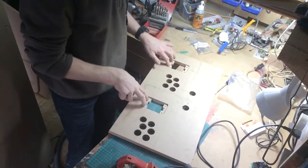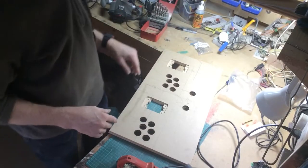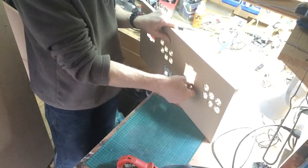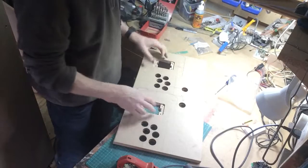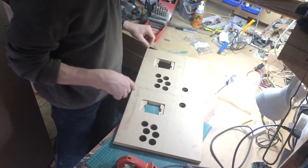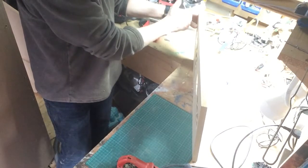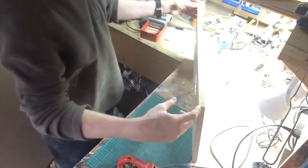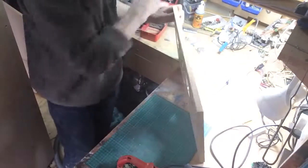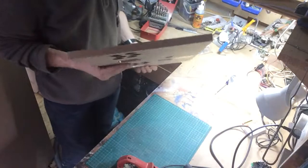So with those two rebates cut, and the installation of those, the holes cut for the buttons — the control panel is structurally finished, I hope. We may think about putting some reinforcement around here, but I think we've got about 10, 11, 12mm of MDF there, so it should be enough to reef on. Those controls get reefed on quite a lot, but what we'll do is actually stick those panels in as well as bolt them in — they should be very firmly attached. We've got to put another strip of wood on the front, about 40-50mm wide, for the two more buttons that go on the front. Then we've got to paint it all, and probably rout a slot along the front to take the decorative moulding, and then that will be finished.